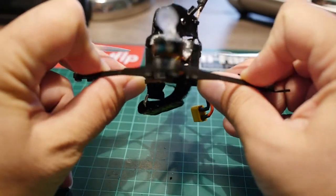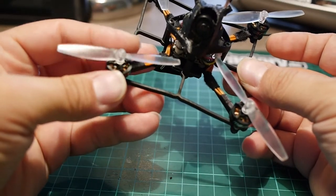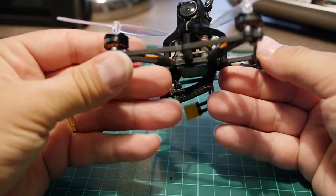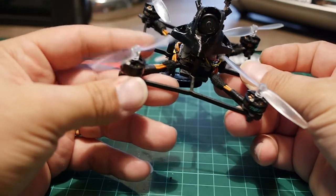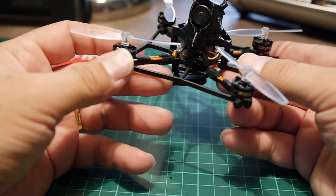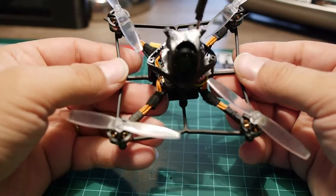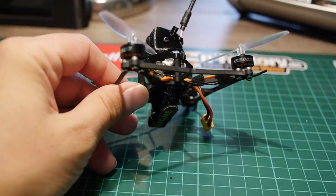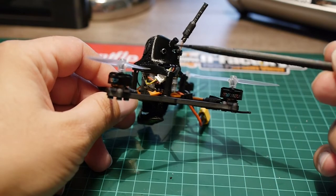As you can see, I can push on it and it barely moves. Among the other great things — all the components on the quadcopter are Diatone products. The motors are the smallest version, the Mamba 1103 8K motors, with quite thick gauge wire, going to a 16x16 millimeter stack which is based on three components: an ESC, a flight controller, and a VTX.